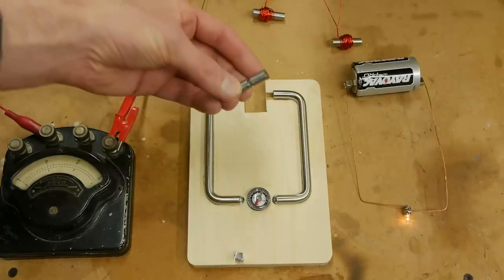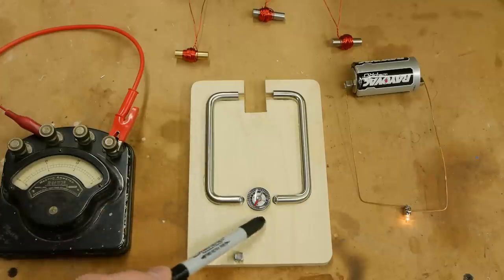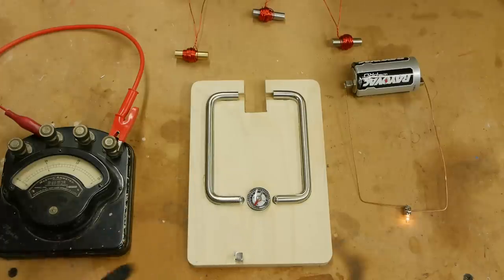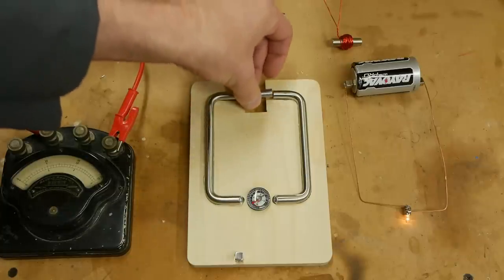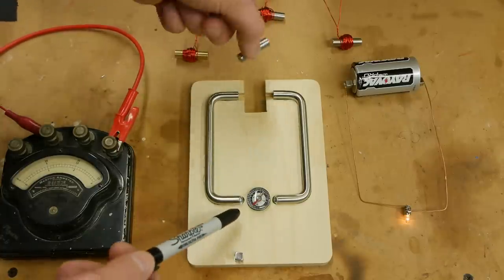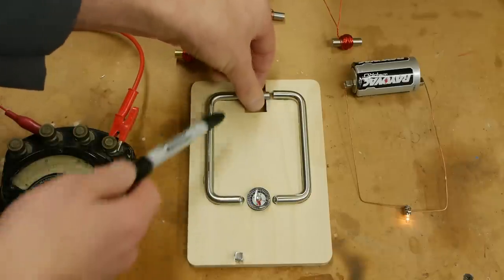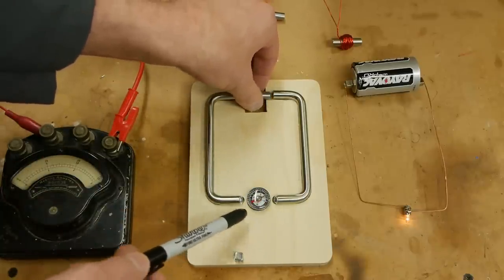I have a little magnet between two pieces of steel, a steel track making a circuit, and a compass to show the field in the gap. There's another magnet here to pull the compass sideways so we can see when there's no field. If I put the magnet in, the compass needle moves, and if I turn it around it goes the other way. If I hold the magnet out in air the compass moves a little, but if I put it into the steel piece the magnetic field has a much easier time making its way out to the compass.